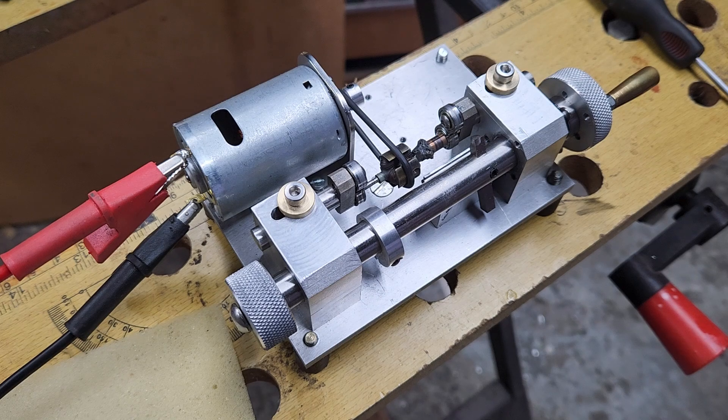This is a 12-volt motor rated about 9,000 RPM at 12 volts. At about 6 volts it turns the armature around 3,000–3,500 RPM, which is fine for cutting. We can speed it up later to polish it. Hopefully every slot car enthusiast has a power supply — I'll switch mine on.